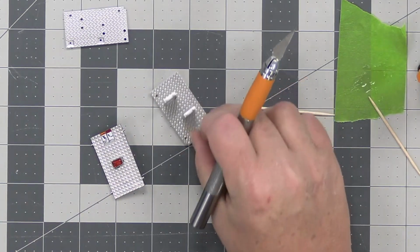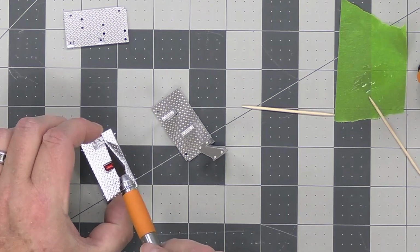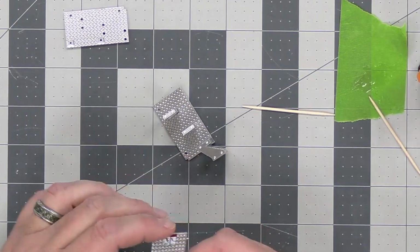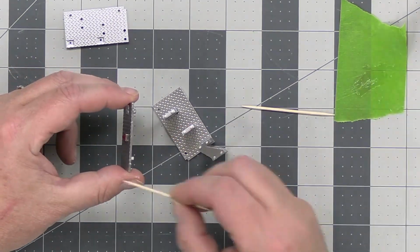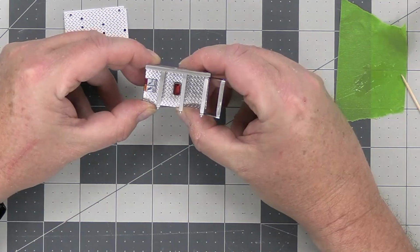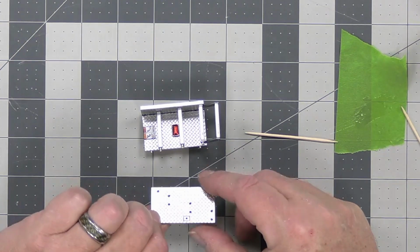We'll bring our step assembly back right here. And then there's two holes right here. With the steps oriented like this, with the labels of this back piece up front here, you're going to put this into here. So we just need some glue all along here. You want to make sure the pegs go completely in. Now the next step in 46 to complete this step is you're just simply going to put the other side onto here.